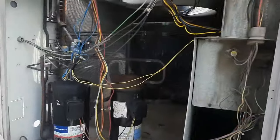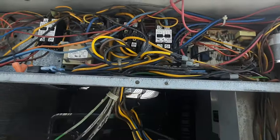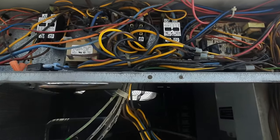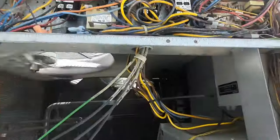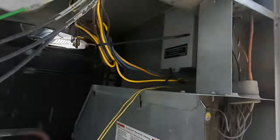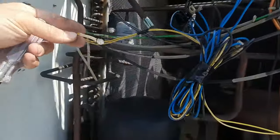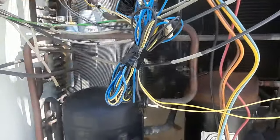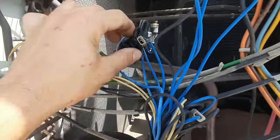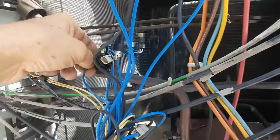Let's take a look at the filters and everything in there shortly. Let's get up here and see why we might have tripped this breaker. Relay is not energized - I'm guessing it's sticking. Both fan motors come off that relay and there's a motor master hiding in here. I'm not sure where that was mounted - discharge or liquid line - probably one of the liquid lines. That's the sensor for the motor master, just hanging. We've got some switches here, there are loss of charge switches.